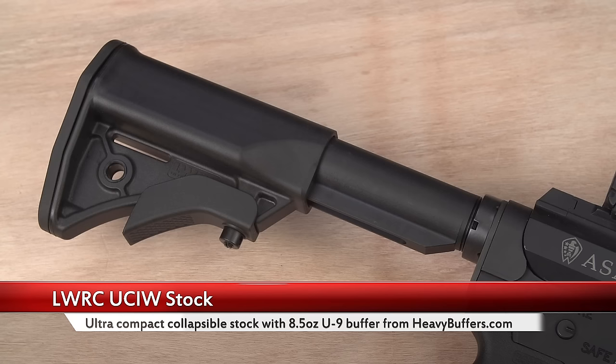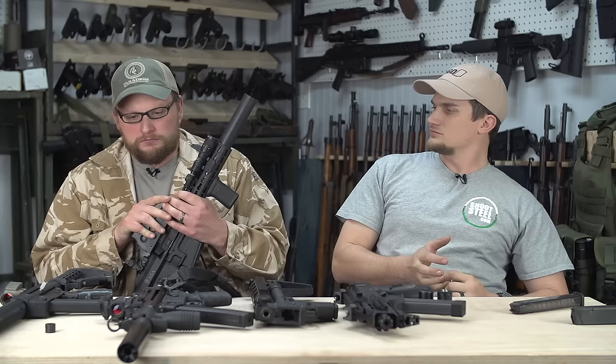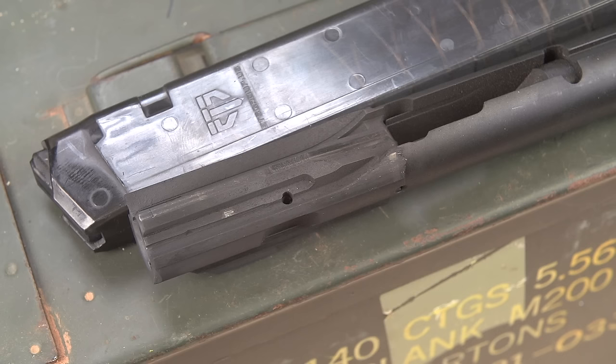Well, I tell you what, there seems to be a lot of snake oil around the whole 9mm AR thing, and unless you buy a factory Colt or something like that, it seems like the ones that people build, especially when you're going to suppress them, there's a bit of difficulty in getting them to run right, but once you get them to run right, they're generally good to go. There is everything from having to machine the bolt to accept Glock magazines and pick up off of Glock magazines. And that's fine. It was a Colt bolt that you cut for Glock mags.